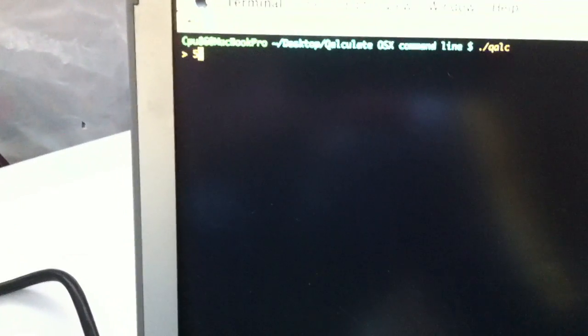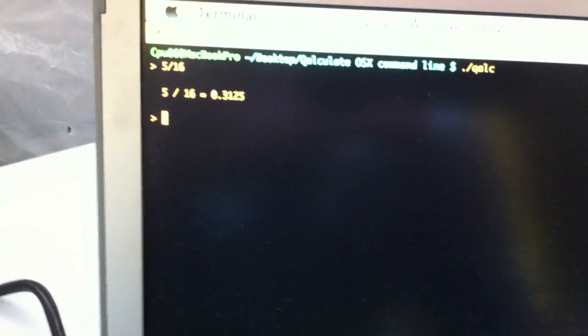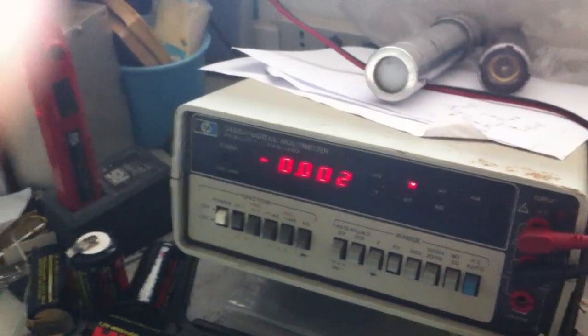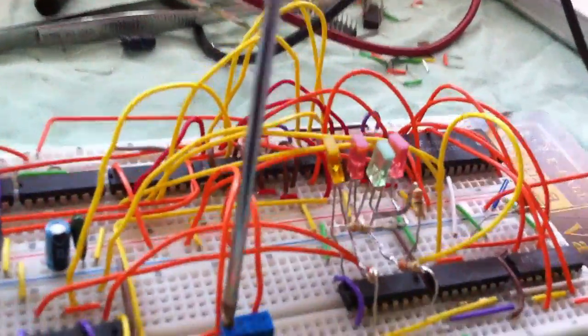This means the LSB is 5 over 16, which is 2 to the fourth — 0.31 volts per LSB. Now it's attached to the voltmeter to check the analog input value. Let's try sweeping it.